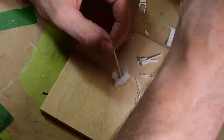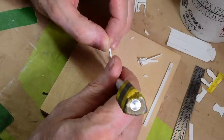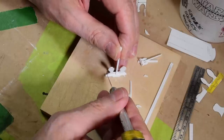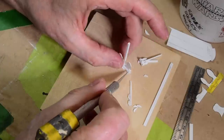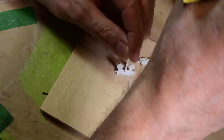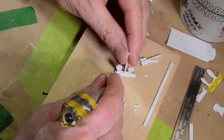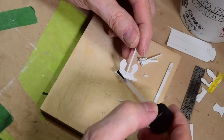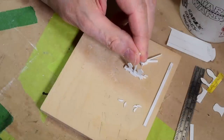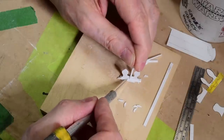I'm going to take this quarter round. I'm going to put a bead of glue in the corner there. I'm going to take a piece of this quarter round, and I'm going to drop it in. Like that. Just hope that the solvent sets quicker than normal, right? Okay, so I'll take this piece, drop that in like that. And I like to take some cement and just flood the thing, because it helps coagulate the plastic, like all the corners and everything, makes them all sit tight and nice, and mushrooms the weld nice. Really fuses the plastic together nicely when you do that.